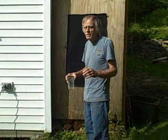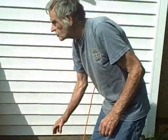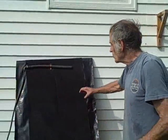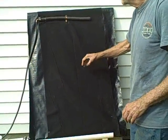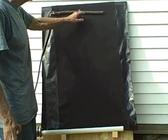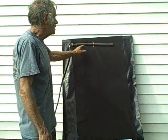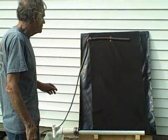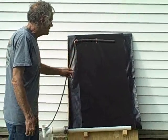Now we'll do an actual demonstration. This is not a finished MTD collector — it's very raw. But we have the trickle-down mat here, the polyester felt. And this is a trickle-down tube — it's just a heater hose, and it has some quarter-inch drip irrigation spigots pressed inside. So if we push water in there, the water will come out of these spigots.